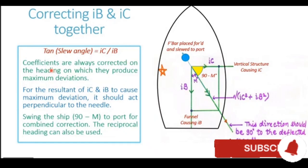Now when we make the combined correction for IC and IB, we have to also find out what is the heading on which the ship should be when the correction is made. Now coefficients are always corrected on a heading on which they produce maximum deviation. For the resultant of IC and IB to cause maximum deviation, it should act perpendicular to the needle. The compass needle always lies in the north-south direction. So for the force to act perpendicular to this direction, this resultant vector should be acting in the easterly direction. If this resultant vector is in the easterly direction, it will be acting at right angles to the compass needle,